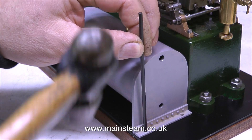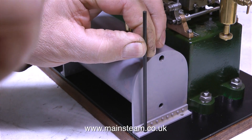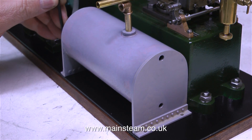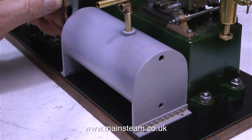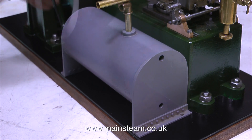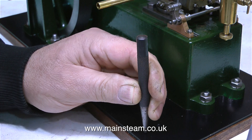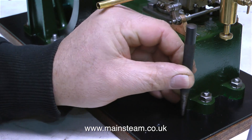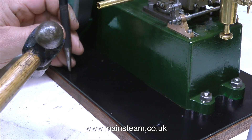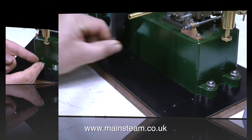In the previous video, I showed how I marked out the position of the hand pump on the boiler's bed plate, not using transfer punches. One viewer was very quick to ask why I didn't use transfer punches for marking out the position of the pump. The answer is simple: the pump's body is wider than the pump's mounting holes, so you can't get a transfer punch in there. You can see 4 impressions made by the transfer punch on the bed plate, and now I'm using a normal centre punch to make these a little bit bigger so that the drill will seat perfectly when I come to drill the holes on the drilling machine, because I don't want the drill to skate all over the paint and make a mess of it.